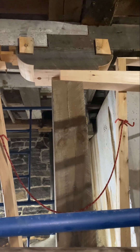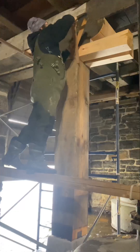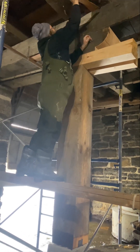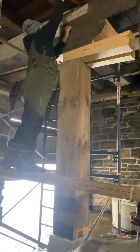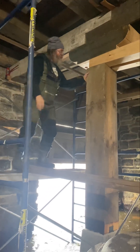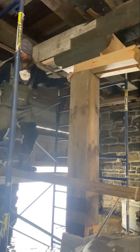We're going to transfer the load. Looks like we didn't cut it too short — that's good, Andrew. Step back for a second so we can see that post. That's pretty decent in there, Andrew. That's quite a post. We still got to come up another kind of inch, so we're going to jack on the bolster block down the side with two 4x4s and a 20-ton hydraulic jack on the other side. Then we're going to lift it and drive these in.